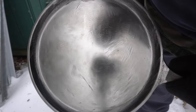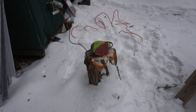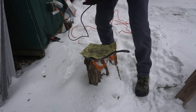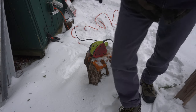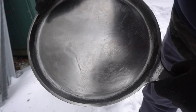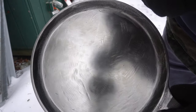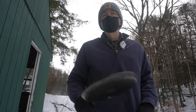That's pretty damn nice. The one final thing I want to try is this really fine grit — looks like 400. Let's see if we can get any more shine out of it. I'm just going to go right on top with this. All right, I am super happy with that. It's nice and smooth. I probably pressed down a little bit too hard with the 80 grit on the angle grinder and created some gouges that are pretty hard to take out, so try not to use too much pressure with that.